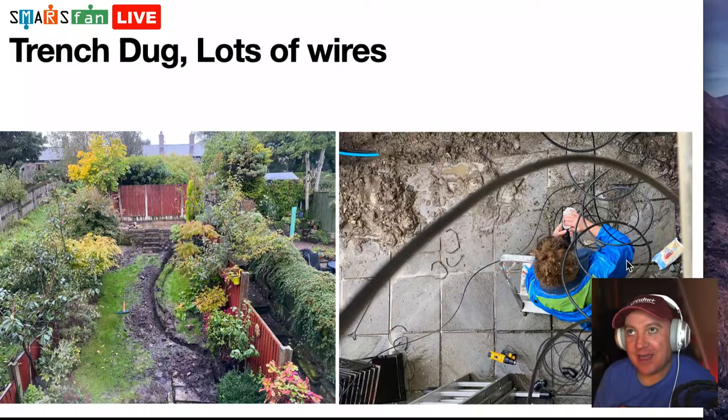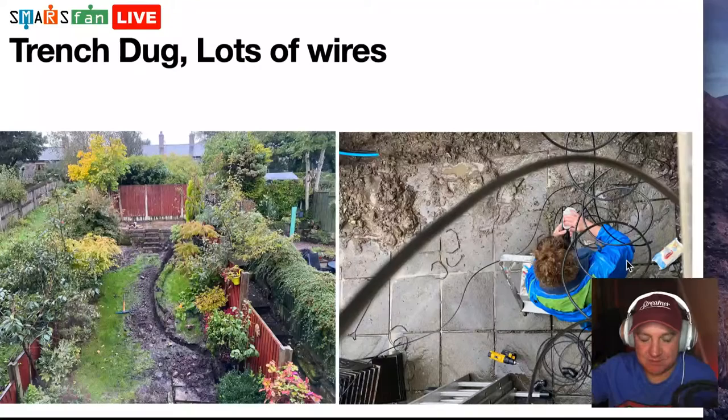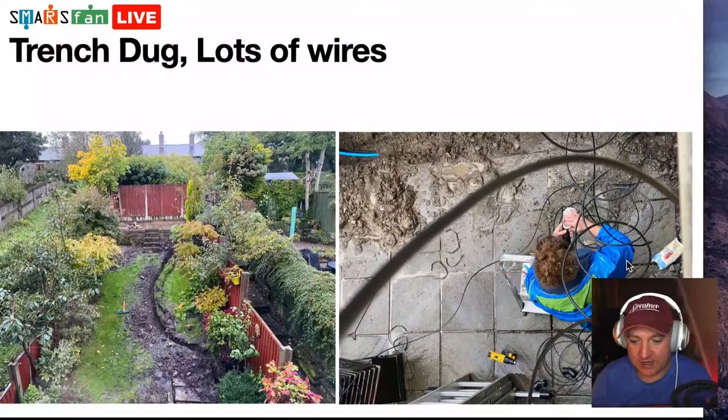So I have in the loft, at the very highest point of my house, some switch equipment for networking, and I've got a couple of computers up there. They're probably going to come to the studio as well, actually. But that's currently where all the wires for the house go. So when I redecorated this living room, over where the fireplace used to be, we don't have a fireplace anymore, and it's not very environmentally friendly, is it, having a fireplace burning stuff? So I used the conduit, the chimney, to stick all the cables down. And this computer here has got a cable, the Xbox and the TV's got Ethernet cables, so it's all wired, and it goes round these skirting boards. So it's all Ethernet, and they all go up into the loft into a big sort of switch cabling harness.